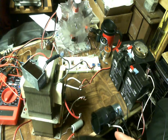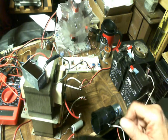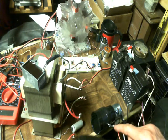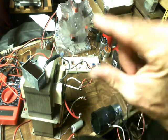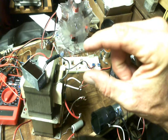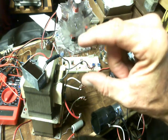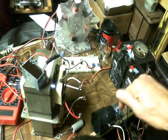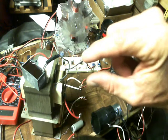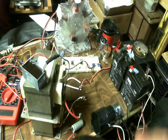Now if you get this thing adjusted just right, or make a better rotary spark gap to make and break the circuit on that battery, then you'll get a better result. I actually had it going steadier earlier. I put a couple screws on the inside so that I could adjust both sides of the brushes, which are made out of brass, so that they just barely touch it. And with it barely making contact like that, that's why you get that doing what it's doing right there. So every time that wheel rolls around off of one of the teeth, it hits an empty spot and breaks the circuit.